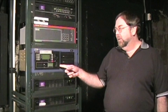So we added a Dolby Digital sound processor and Dolby Digital sound heads on the projectors. We added a DTS sound processor for DTS digital sound. We also can run Dolby SR, and we can run mono, which is what you have to run films like Casablanca in. If you don't run Casablanca in mono, it'll become garbled. You won't be able to understand what they're saying. You have to run the correct film in the correct format to be able to have the right sound.